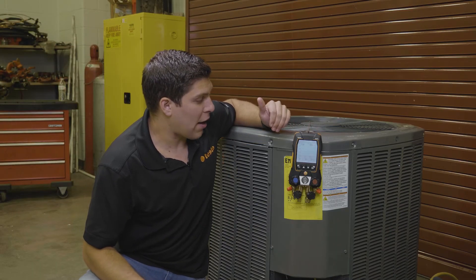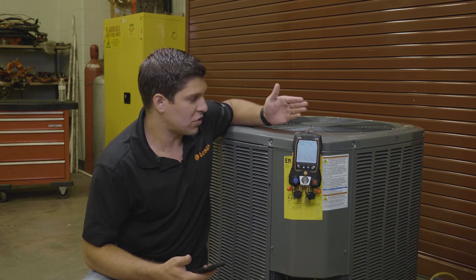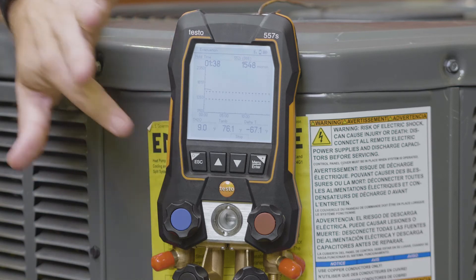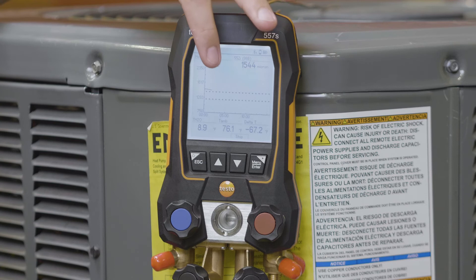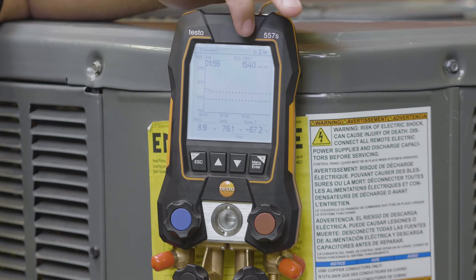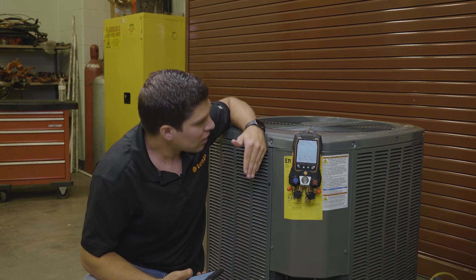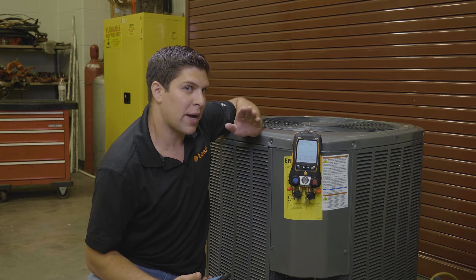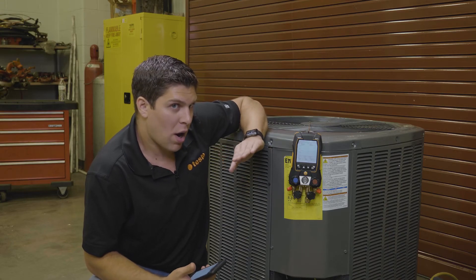We're getting closer to our maximum decay target. I did adjust it from the beginning — we had it down to 1,500, which is the factory setting from Testo, but just for demonstration purposes I wanted to show how the graph and target lines are working. You've got the big display showing everything live: your temperatures and internals, your ambient temperature, your delta temperatures, your timer — which is very handy — and your 552i connected giving micron readings all live. I have it set to about 1,500 microns, and the line is just about ready to touch 1,500. My actual evacuation target is set to about 1,250, so my goal is to hit 1,250.